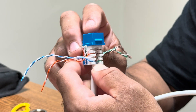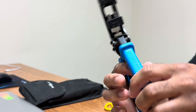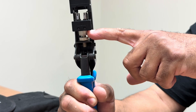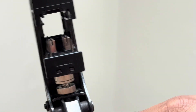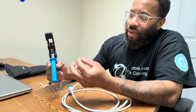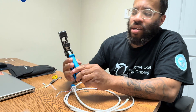Now that I've verified that all my cables are in the correct way, we're going to use the speed jacker. The speed jacker has many adjustments that you can do with this screw right in here — this bottom screw. When you squeeze it, it will free that up to allow you to be able to twist it up or down. As you loosen that, this top one — if you turn it up or down — you will see that this, which is where the teeth are, is going to move up or down. So right now we have it at a good setting, but if I was needing to make adjustments — let's say I go to cut it and it's not cutting everyone off correctly — I can make little adjustments. And then once I find a sweet spot, this bottom one, if I turn that clockwise, that's going to lock that into place and you shouldn't have to make adjustment for a while.